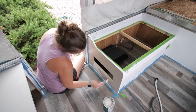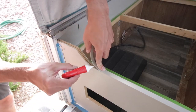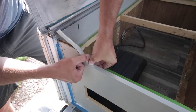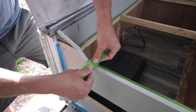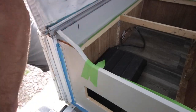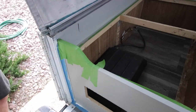After she was done, I went in and fixed some of the edge banding that was coming up. To do that, I grabbed some Loctite Extreme Glue, peeled some of it back, and then applied the glue as much as I could. I made sure to have a paper towel handy in case it leaked out, and then I just pressed it down really firm. Then I grabbed some painter's tape and used strips to press down on it and make sure it was holding securely while it could dry. Now it's secure and I'll give it a day to make sure it sets well.